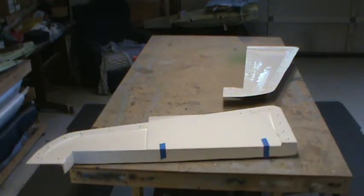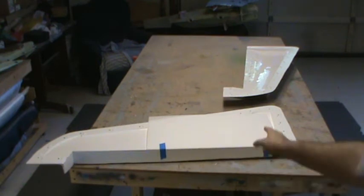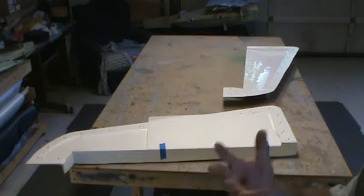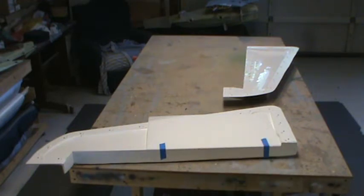See, I got the wing mold out, and I got some 3mm Rohacell on there right now. The Rohacell and the Airex is very similar. This stuff is identical, and it has fairly similar properties to the stuff I'm planning on using on the flying model, and this is just stuff I've got. This wing that I'm going to lay up eventually is just a test wing that I'm going to load up to destruction until it fails, just so I can see how my layup's going to work. To make up these internal panels is somewhat, it's just time consuming. It's not really difficult.